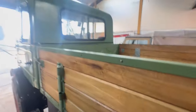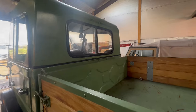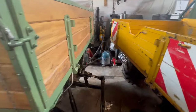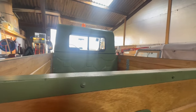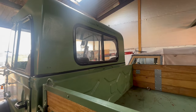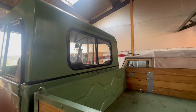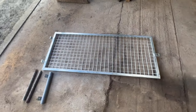So what I thought I would do is make a headboard to go on the top of the tipper body, but I want it to be removable. The reason is that if I'm using a chipper on the back of the Unimog, it throws all the chip in the back — which is fantastic — but some of that chip goes down between the cab and the tipper body, and if I've got the window open, some of it goes inside the cab. So having some sort of header board here that I could reduce the amount of chip going in by rolling a piece of canvas down over this frame would be really handy.